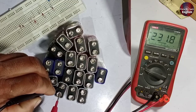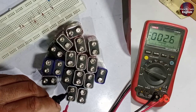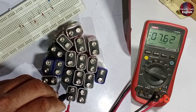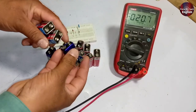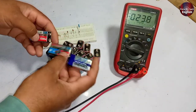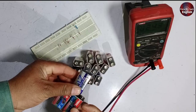This battery is completely dead, I will remove it. The batteries with some voltage remaining I keep with me — this one is showing 7 volts. All of these old dead batteries have some life left in them. I will attach them in series, because when we attach batteries in series the voltage adds up. I will attach all these batteries and start testing the component.